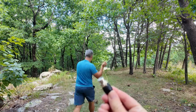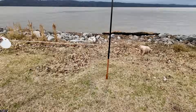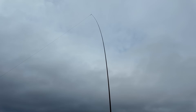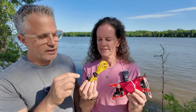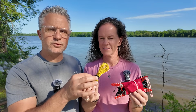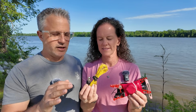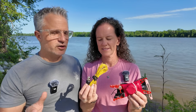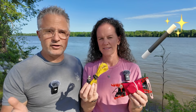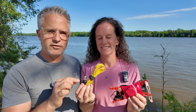Now that we've done a lot of Parks on the Air, some Summits on the Air, and lots of portable operations, we really like to get everything up and going and have fun as soon as possible. With an end-fed half wave, we really just have to get one side up in the air somehow and one side connected to the radio. This one in particular doesn't require coax. Technically, your coax with an end-fed half wave normally acts as your counterpoise or ground plane for the other half of the antenna, but especially on QRP we've just found that it doesn't matter. So the K6ARK has been our go-to favorite.